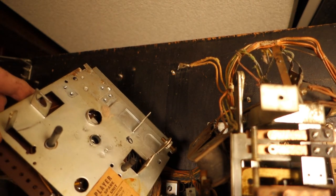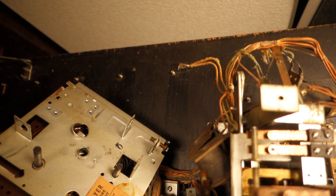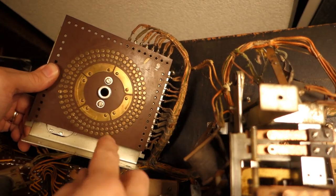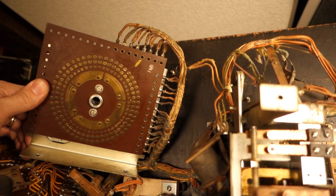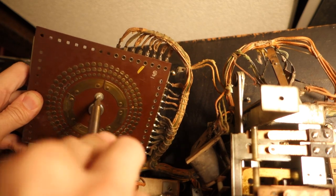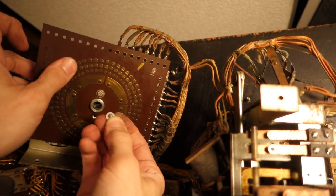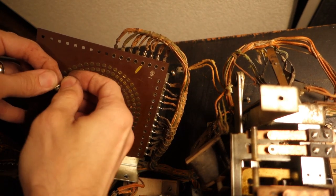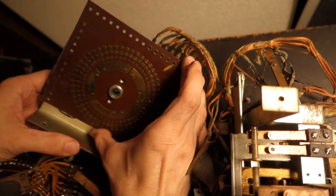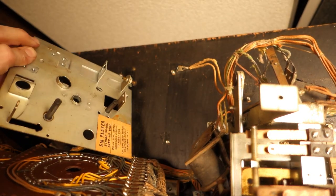Here's a little bit of insulation that the rodents left over - put that in the garbage. Carefully turn this guy around and take those screws off - very short screws, with a built-on lock washer and a flat washer, comes off really quick. This is what pivots for your adjustment - that's how you do your adjustment here. Pull the plate away and there's our plate for number five. You never really want to adjust this unless there's an issue.